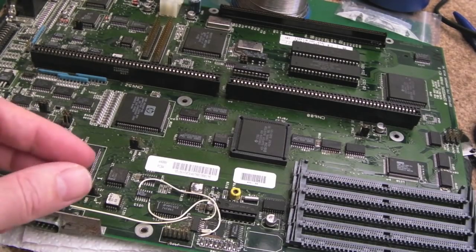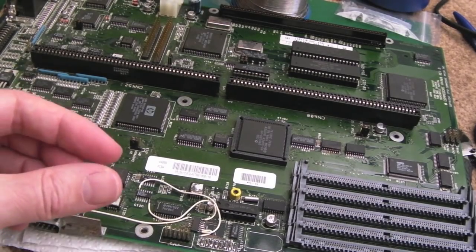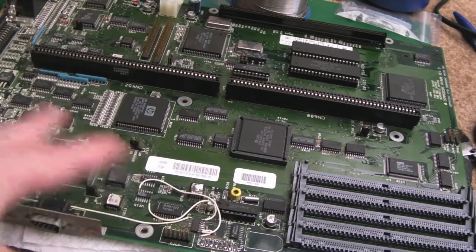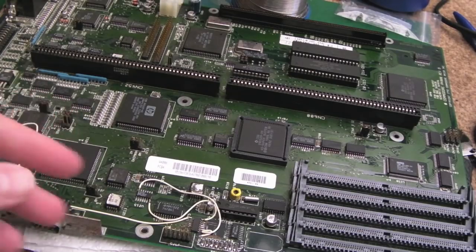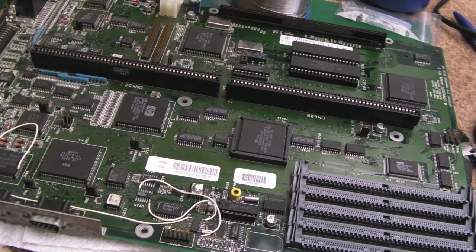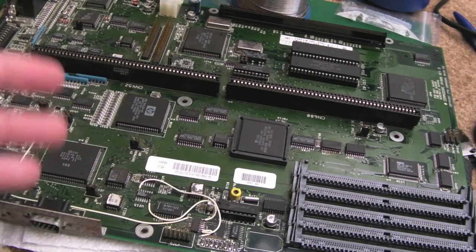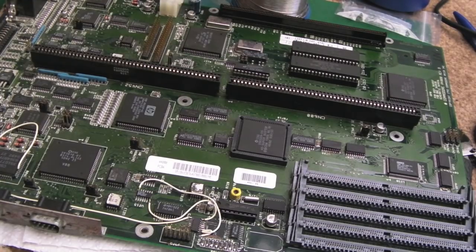So it could be the board's warming around a chip somewhere, and it's pulling a trace apart where a trace is corroded and broken. It's barely making a connection. That could be the issue. It could also be that the electrolyte is around various things here, and that electrolyte is starting to hold a charge or something. I don't know whether you'd be able to do that, because you need metals and things. The electrolyte on its own is probably not enough to do that, but it's weird anyway, nevertheless. So I'm going to just clean again here.